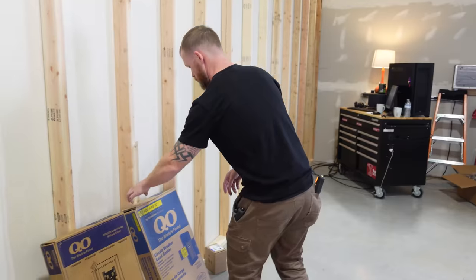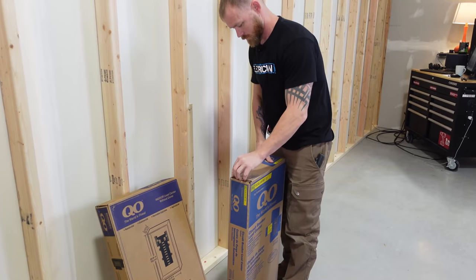Sometimes there are installations where we don't need to have a breaker that de-energizes the entire panel, and sometimes we do. It just depends on the environment and kind of where we are, if it's a feeder or branch circuit. There's a lot of different reasons why we might have one or the other. So let's talk about the MLO panel, the main lug only.